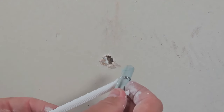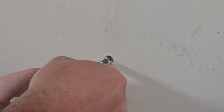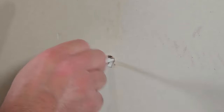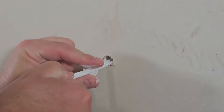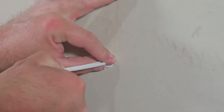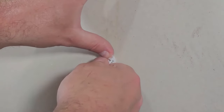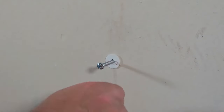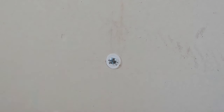A quick way to get around the standard toggle bolt issue is the flip toggle, and that's really simple to use. All you're going to do is flip this down like this, then slide that in. It flips out the back and you've got a lot more room, which is nice. Then you pull it tight against the wall, hold it down, snap it off, and take your screw to hang your product. That's a good solution — it's reasonably quick and you don't have to hang the product at the same time, which gets around the standard toggle bolt issue.